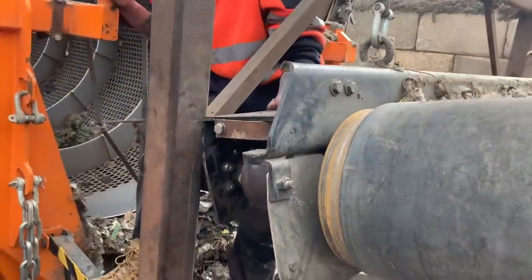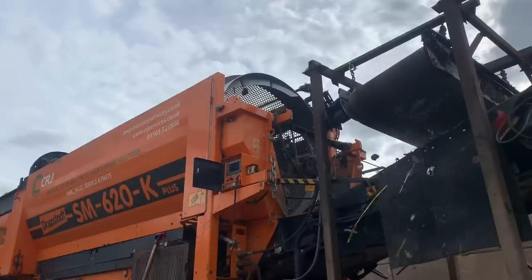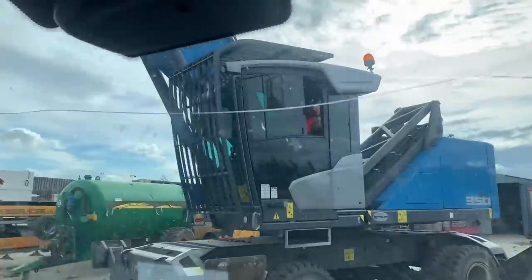That's not hitting it, Christophe. Look at that - that's beautiful. Look at that bracketing skill from me and Christophe. Teamwork makes the dream work. That'll be alright now - a bit of a wobble on it, but if it was rigid it would just break itself apart, it's got to have a bit of play in it. What had happened is it had no support, and all it's done is wriggled itself off and snapped that Woodruff key right at the tip. So all we did is push it back on and put that bracing bracket around it - she'll be sweet.